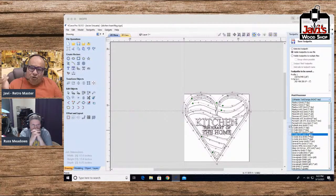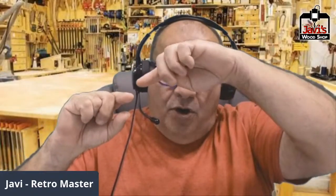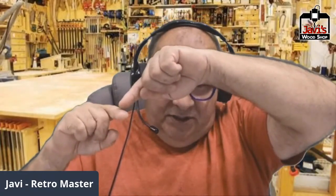That way a circle, for example, will be drawn thusly. You've got a circle with 4 points, that's 4 arcs, an arc from here to here, here to here, here to here, and here to here. Every 90 degrees, it's a 90-degree arc. And so you will see your machine go with arcs. You'll see it go zoom, zoom, zoom, zoom. Now, obviously, it won't slow down if you put continuous or whatever. It'll go one big circle.